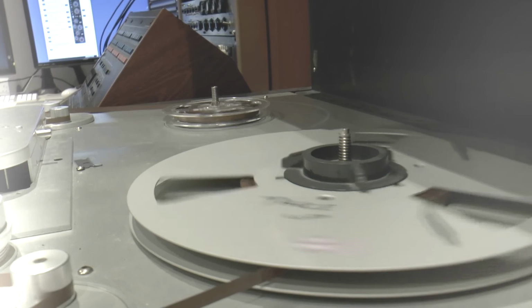Now I'm going to patch the last few things in. We've already got the A80 out into tape 2 so we can hear it. But we need to create a signal going into the machine which it will record. So I believe we go on CD out, left, right. And what comes out must come in to the A80. Now, because we're recording, we've got to send this onto ready again. Energy is now flowing through the record head. And then you press your play button.